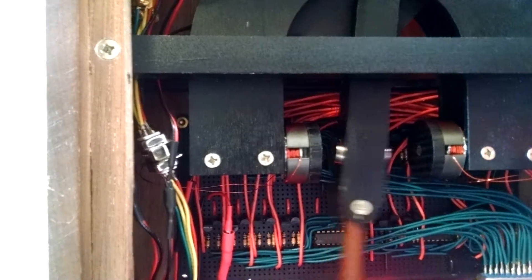Right here you can see these are the coils, and they power the pendulum. In the pendulum there are permanent magnets. The coils have current run through them in timed pulses to give the pendulum a little push using those magnets.